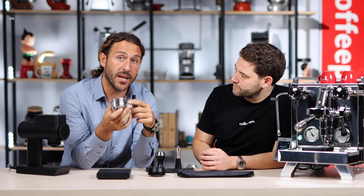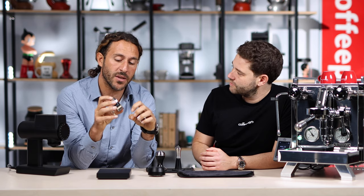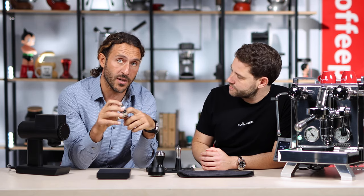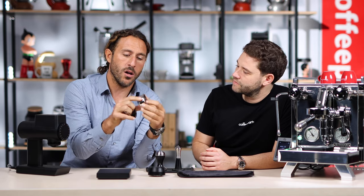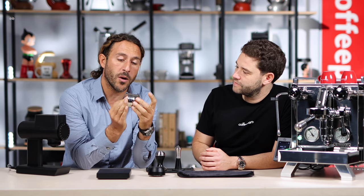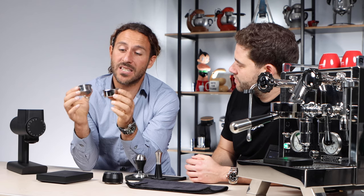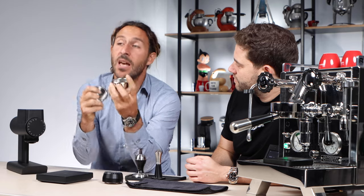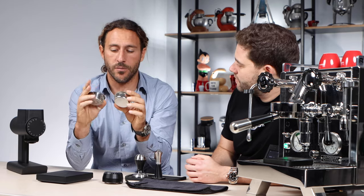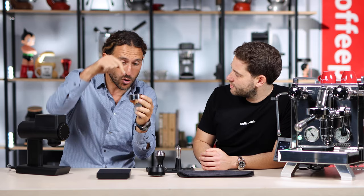What we can achieve with a thicker metal is actually the same diameter at the top and the same diameter at the bottom. So you've got a perfect cylinder — 58.7 millimeters at the top, 58.7 millimeters at the bottom. With the thinner one, because it's thinner, the metal will stretch. So you've got 58.7 millimeters at the top, but at the bottom you're losing probably a good three or four millimeters on each side. The difference is the flow — when the water is flowing on the edges, it's getting restricted at the bottom. With this one, the water just flows freely because it's free to go straight down.